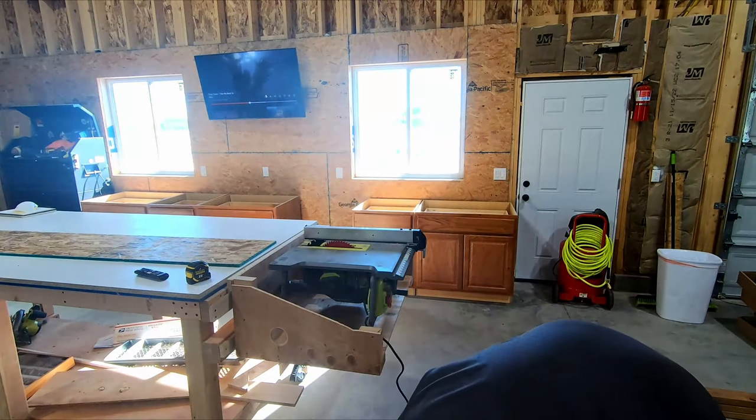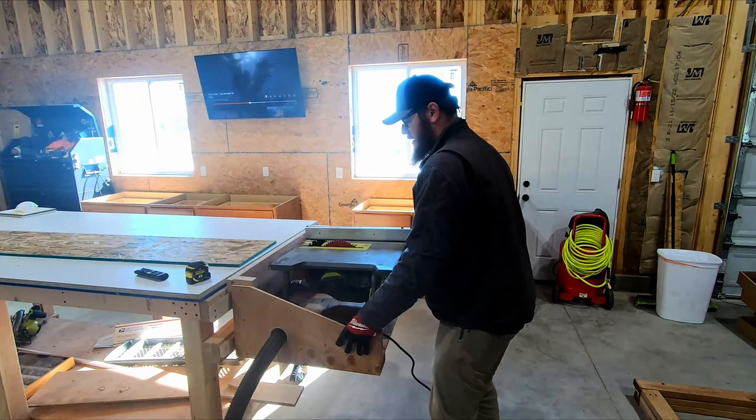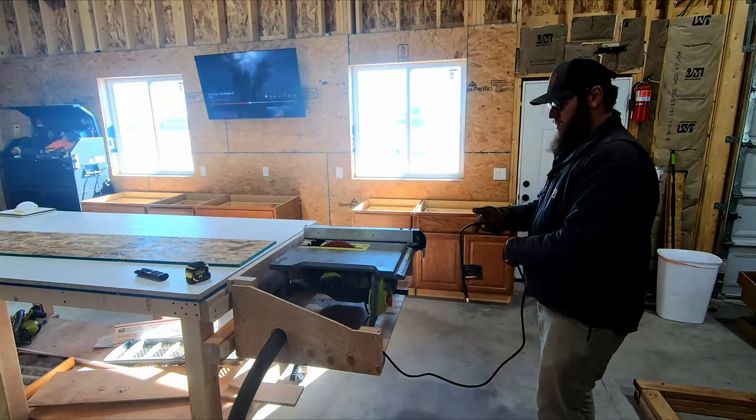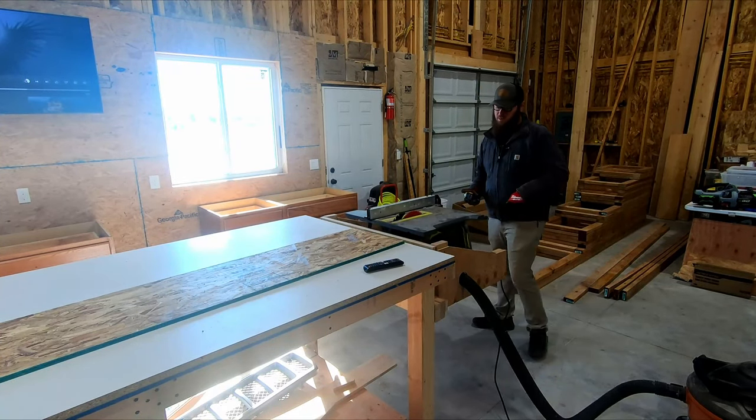It's been really strong without any strapping. I'll put my table saw on here, and I have a hole in the side for my shop vac — I can feed the shop vac hose through there and there's a 90-degree elbow on the back side of the vacuum port. I have my fence set up at four and three-quarter inches and I'm going to start ripping down this OSB.